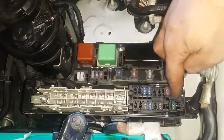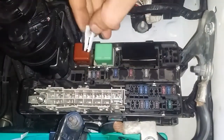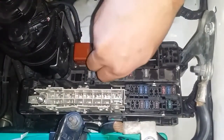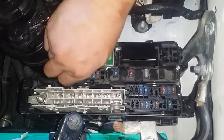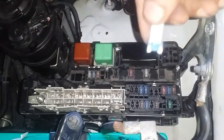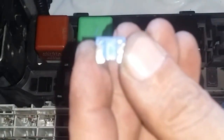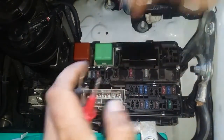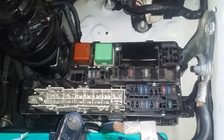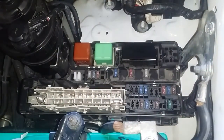You might also want to check this series of fuses one by one. To help pull them, they were kind enough to provide us a fuse puller that comes with the fuse box. What you really want to see is that A-shape — it should be connected. To fully test that, do so with a continuity test. I've checked all of these already and everything is in order, no problem there.